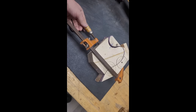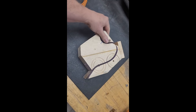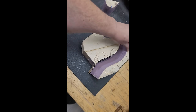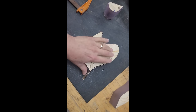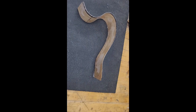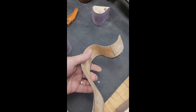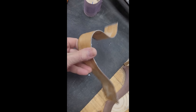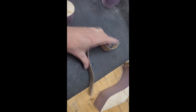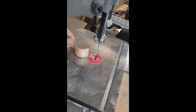So what you're seeing here is attempt number three — I'd forgotten to record the trashcan footage for number two. Attempt number two was a step in the right direction, but I found that the laminates made a piece that was too thick. It cupped, it warped, and it didn't hold its shape very well. So the third time around, I used a slightly thinner veneer and an inner layer of carbon graphite fabric. I also decided to use marine epoxy as the glue. Third time's the charm — it came out perfectly without any of the other issues I had before.